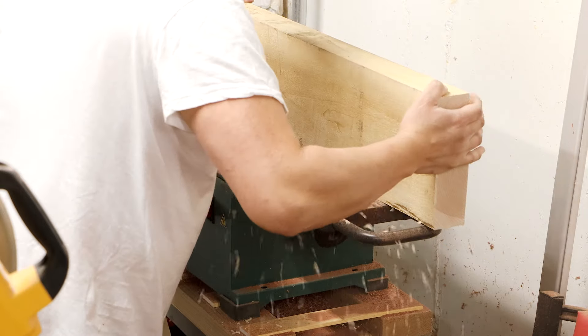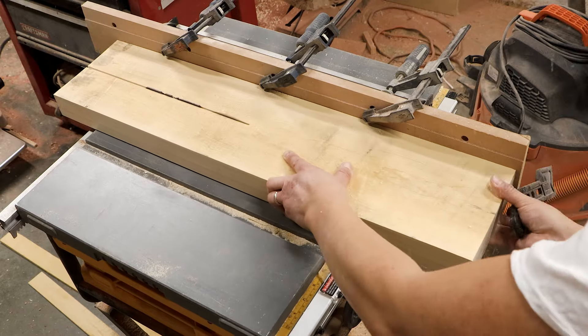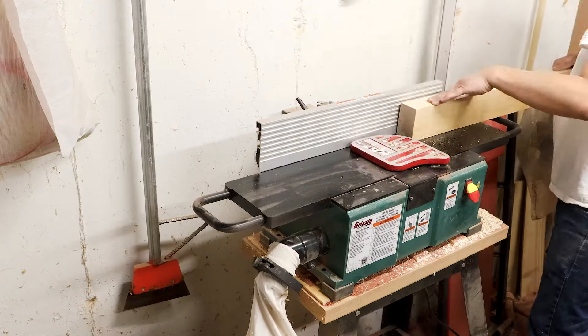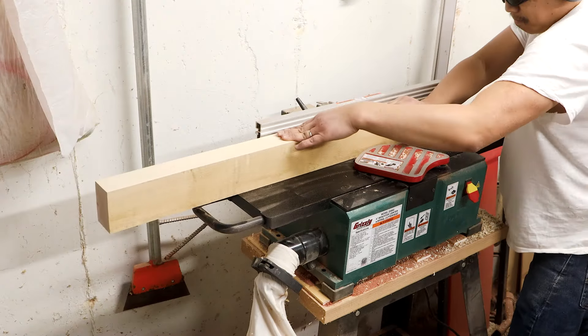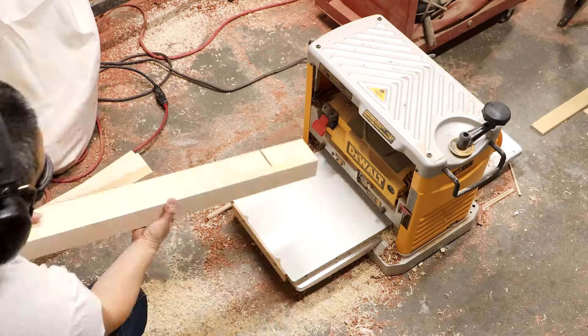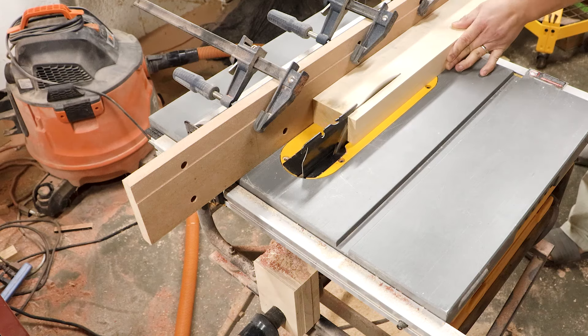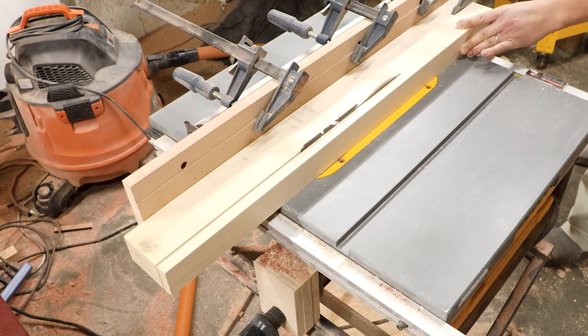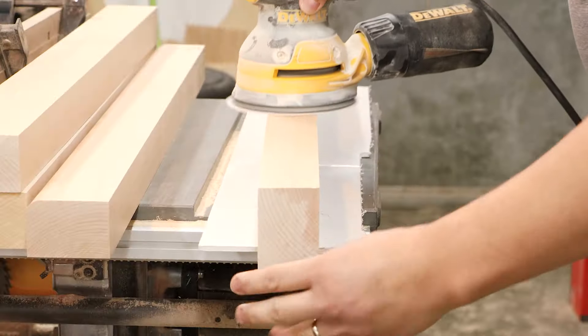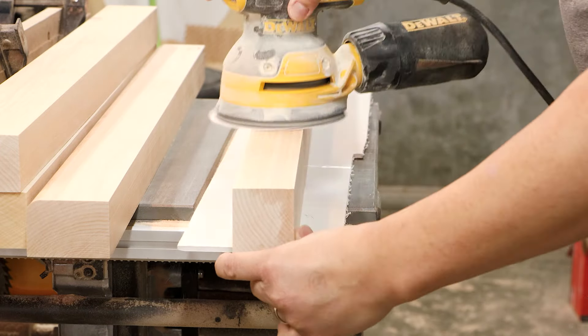For the final touch, I wanted some friction-fit watch holders to make the case stand out. I started by scoring a large 8-quarter rough-cut maple and cut them down to 2-by-3 strips. I sanded them down to 400 grit then locked the boards in place to round the edges with my trim router. I've been using my table saw a lot as extra bench space and sometimes I can get away with some unusual clamping configurations.